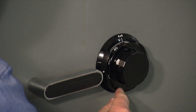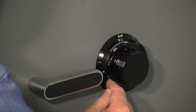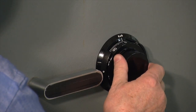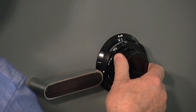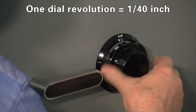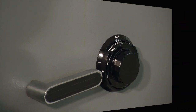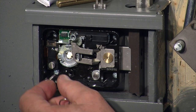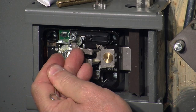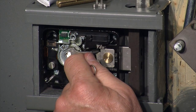We're going to leave this dial so that it's slightly raised above the ridge that runs around the perimeter of the dial ring, and I'm going to place zero at the opening index. I can feel — I'm holding the drive cam inside the safe — there's a little binding in the dial, so I'm going to back it out one full revolution. Then I'll go to the inside and temporarily install the spline key. Remember that the dial is at zero. Holding the dial in that position, I manually rotate the drive cam until the opening, or the gate, is lined up underneath the lever nose so the lever can move freely up and down.